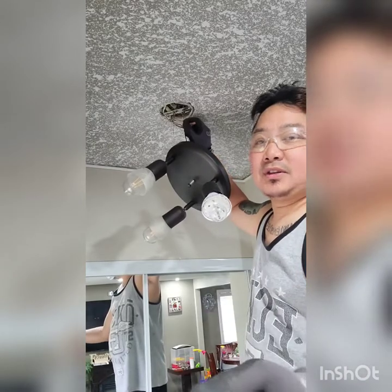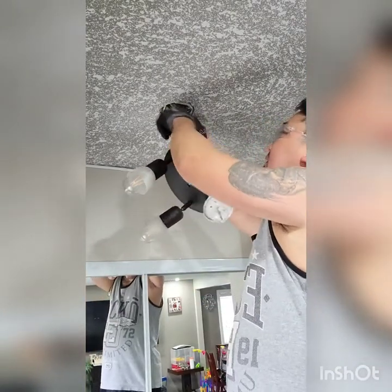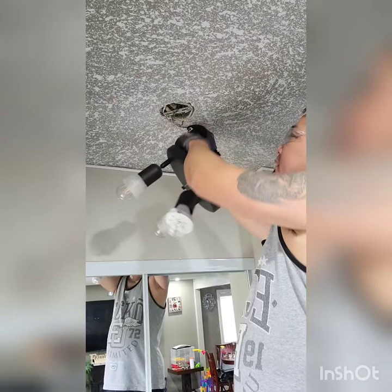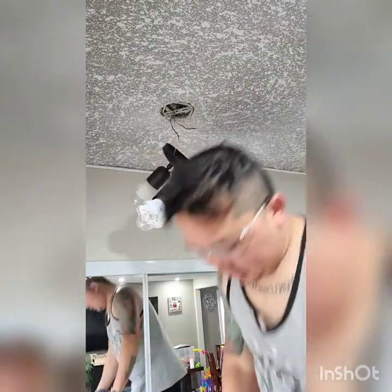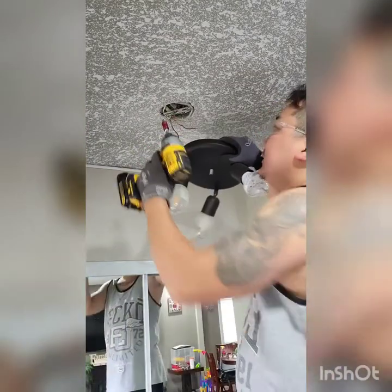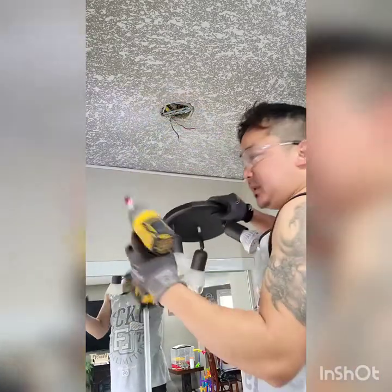Okay, so we're gonna remove the wire. Oh, I'm not a licensed electrician, and if you're not comfortable doing this, you should call an electrician. And always be safe, okay? So this thing, I'm just gonna remove this. The black one, same thing, loosen it up a bit, and then you're gonna remove the green screw that's holding it using a flat head screwdriver. Any screwdriver also works, but this one has a light to see it clearly. Now it's off.